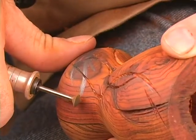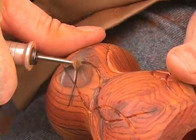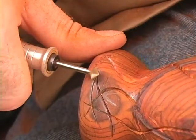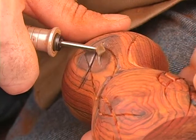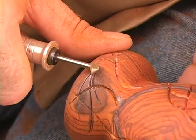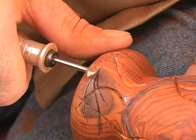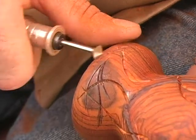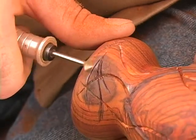Use the pencil lines only as a guide when carving — don't try to trace over them with the cutter, because if you do that, you won't cut fluid lines. Study the relationship of all the cut lines and how they play off one another. The trickiest part of cutting fluid curves is trying to get the cutter to enter the previous cut. By doing so, you create a seamless, fluid line. This can only be achieved with practice, so take your time in the early stages when learning to carve, and it will become second nature before you know it.